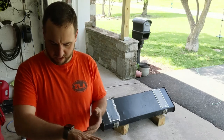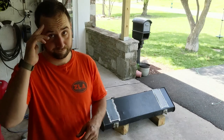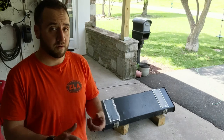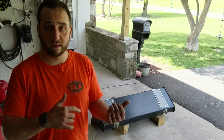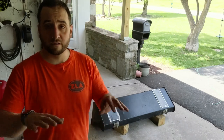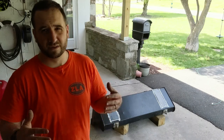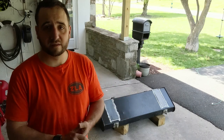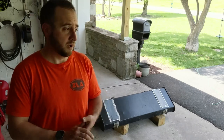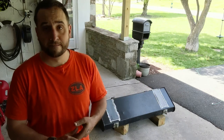Welding sparks got me kind of hot right now, and the wifey said, let's go for a ride on the bike. So, yes, ma'am. I'm going to stop here, probably later tonight go ahead and finish up the grinding, get the MIG welder out, fill in all my cracks, holes, crevices, whatever, grind one more time, then do a paint grind, which is really just more of a scuff, just to get the paint off of there. It's pretty good paint on these stock buckets, so it does take some time. And then grind off the plate and weld that on.